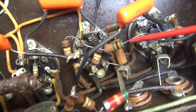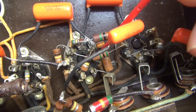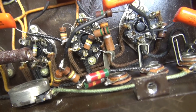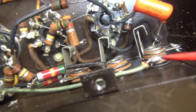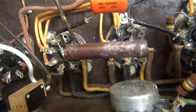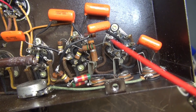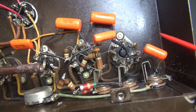If you look right down here, by this 10K resistor, you'll see a glob of solder between the two pins on that tube socket. There are a lot of solder globs laying around here. I followed my way across and was just spotting multiple bad solder connections, including this one on the input jack — it's actually cracked. Over here, this capacitor goes right to the grid of one of the 6V6s. Loose on a goose. So here's the plan: we're going to replace the input jack and re-solder these connections and see what that does to the noise level.